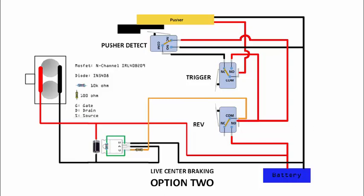But anyway, the good thing in this setup is that you have a quick way to stop the runaway if it ever happens. So I think this is quite a nice way whereby you can have the best of both worlds. If you depress the ref, it's like a live center, and if you release the ref, everything else, I think it acts almost like a dead center.